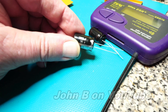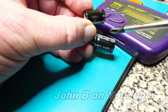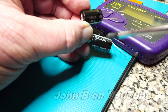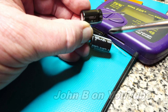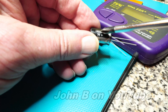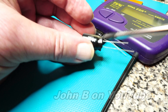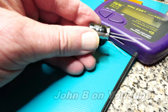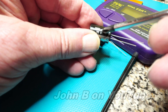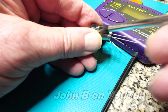I haven't got any 1000 microfarad 25V caps, but I've got these 1000 microfarad 35V ones — Matsushita Panasonic. Ideally you should stick to the rated voltage, because this capacitor will measure 1000 microfarads at 25 volts, or 1000 microfarads at two-thirds of its rated voltage. So you need two-thirds of that voltage to get the rated capacitance. Since there's less than 25 volts here, we're not going to see the full 1000 microfarads. Just a little tip. But since I'm putting in brand-new 35V caps, these are going to be better than those old ones. You never want to lower the voltage unless you know for a fact the voltage will be lower than the marked voltage on the cap.